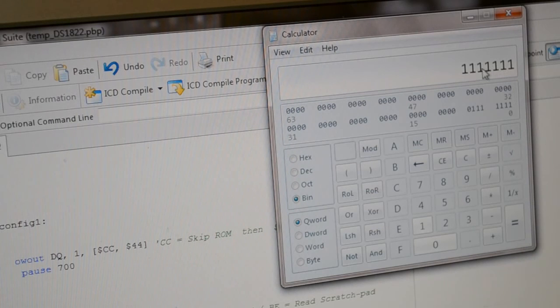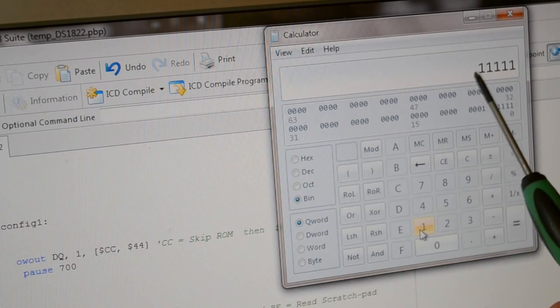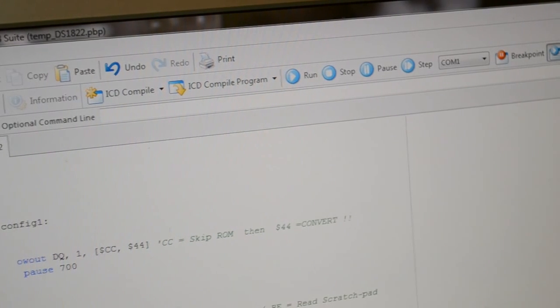So the temperature is creeping up in small steps — maybe 0.0625 at a time. The numbers are going up but it's actually coming down in temperature because I put it on fast freeze. Here's the 15th bit: a '1' tells us it's negative; if it changes to '0' it's going positive. Some people say to look at the 11th bit, but with 12-bit code I believe the first three bits are ignored in the temperature conversion — I'll demonstrate that later.